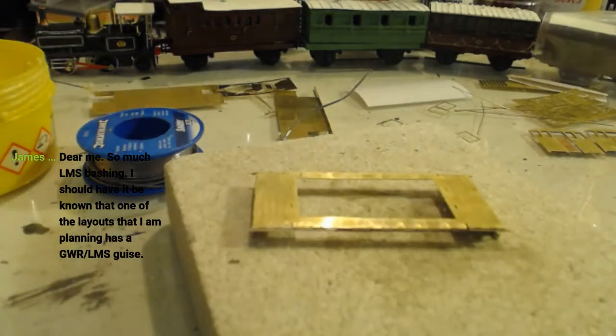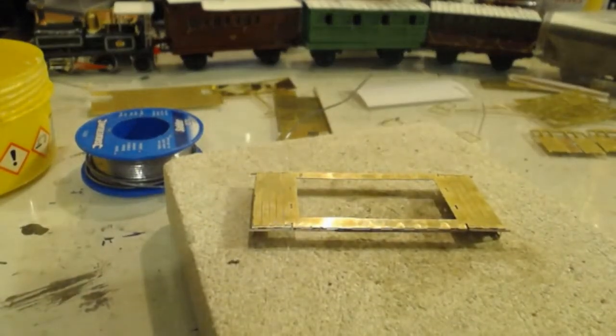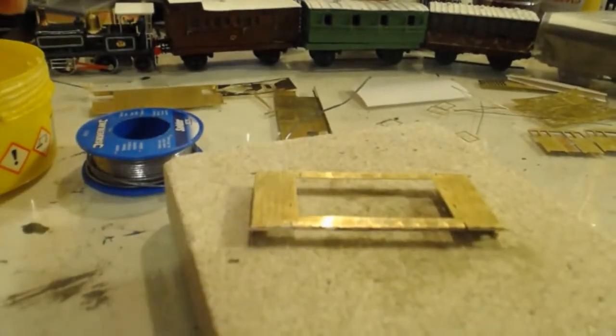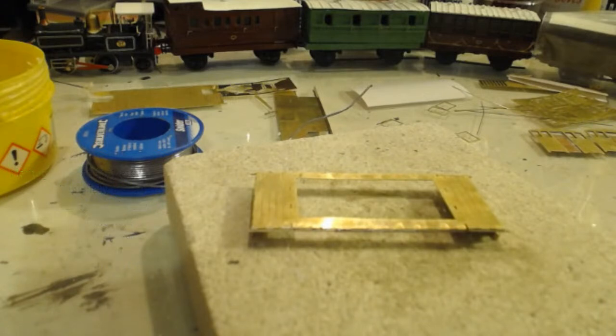Well, what I'm going to do is use a pen and mark on here where I am. And every so often, I'll get to a point where I'll just mark it again. Start body assembly by tacking the van end to the floor, locate in slots. Keep the end square to the floor, lay the unit on its side and attach one side by tacking to the floor flange, maintaining edge alignment and a flat floor, turn on to its base, and tack the top flange, skipping the other end.